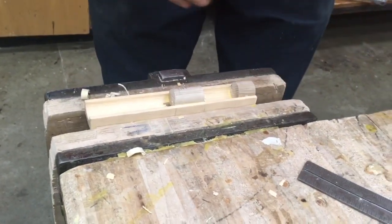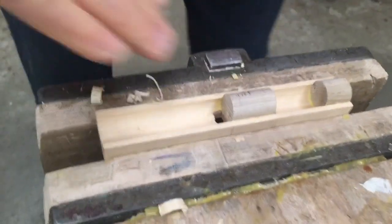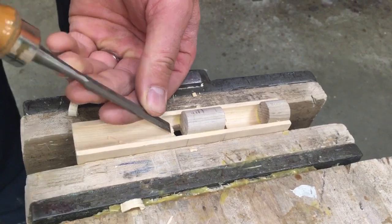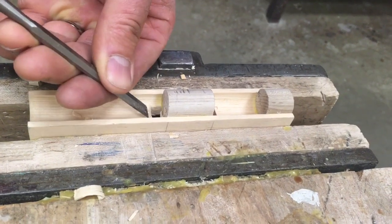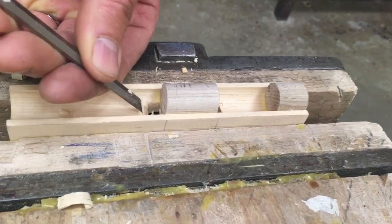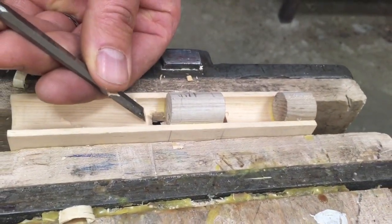Yours are much longer. We have to put an angle on this part, sloping down, and I'm going to do that with a chisel at about 45 degrees. I'm just going to be slicing down like this until I get to the surface — and you don't want to go much further. You don't want to go past the surface.